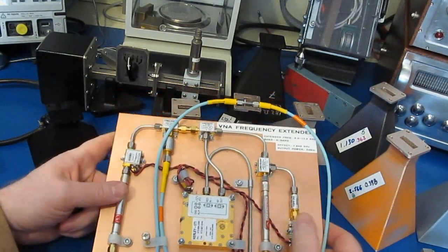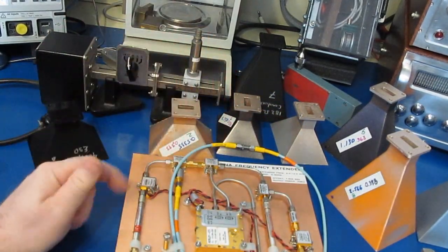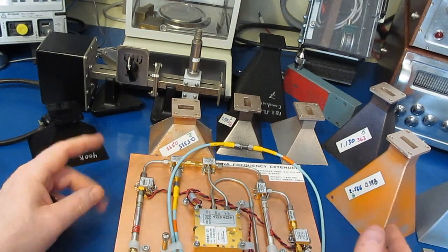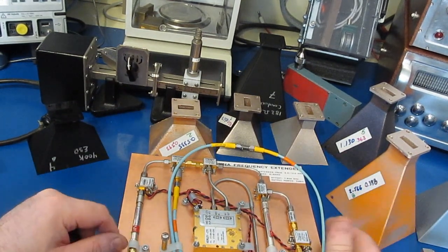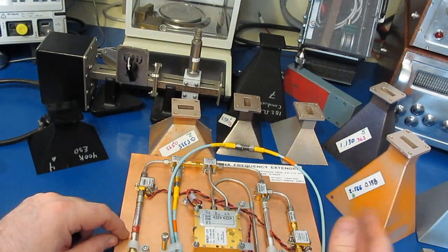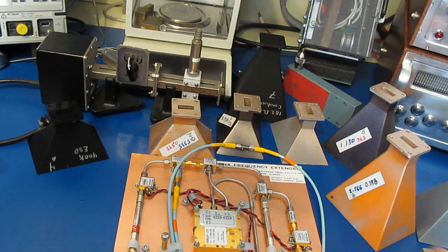Everything was fine, and we continued on our testing, but I continued the rest of the test using a wrist strap. So my advice, always wear a wrist strap. Even if you think everything's grounded, it's not worth it. By the time I ordered the parts, I got everything changed out, retested, I lost a few days just to that. So don't be stupid like I was.